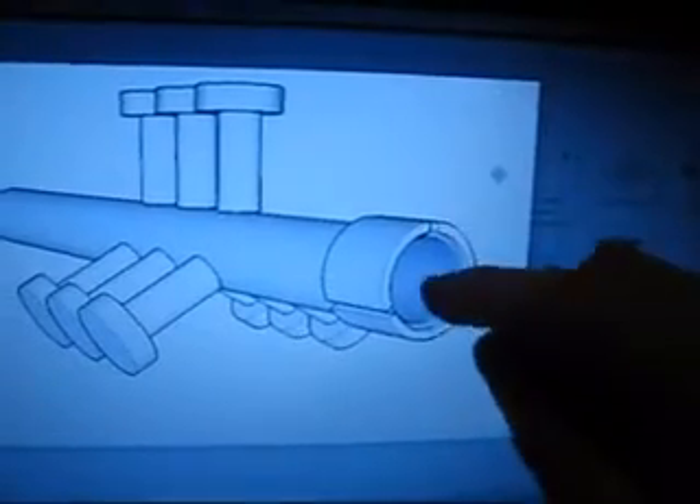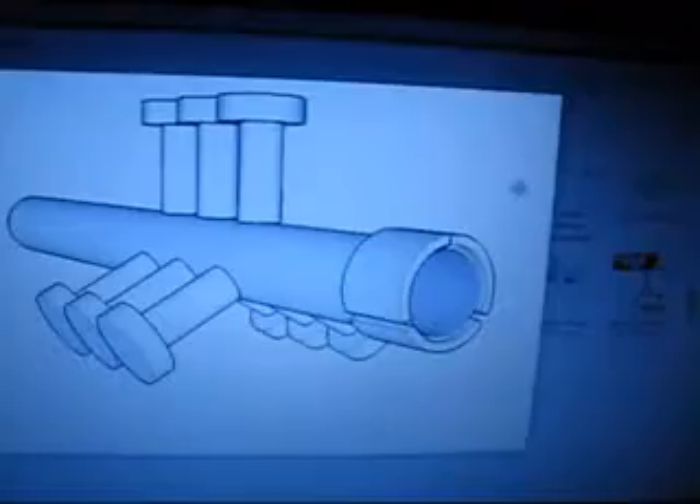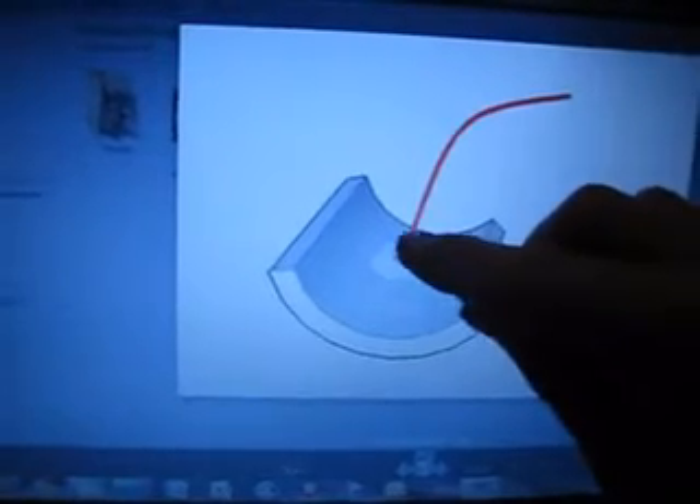The gap's important. The degrees between each gap is vital for the smooth operation of the motor. And next I had to solder the connecting wires inside of the commutator plates. These wires went through the centre of the armature shaft.